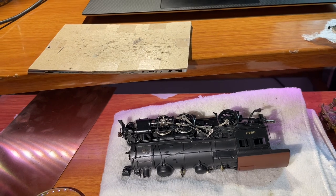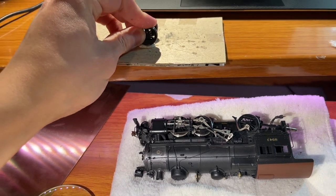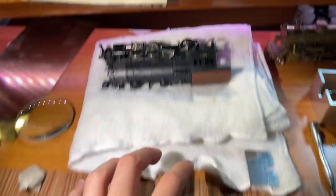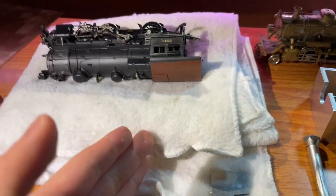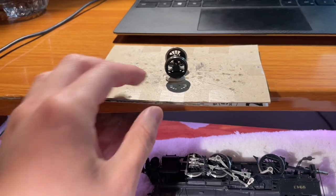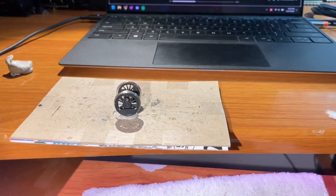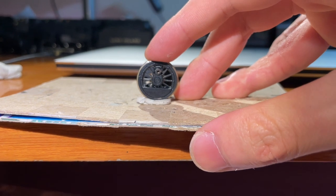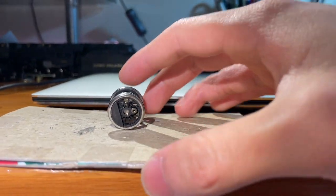This is far from properly 90 degrees, and I'm not going to push this wheel in by hand — especially with one hand. But you can see roughly that this has to be 90 degrees off, in this case to the left of the non-insulated wheel. So now with that done, we can do some fine-tuning. This is where a piece of paper and either some tape or silly putty comes in very useful. You can do this two ways — I like to put a little bit of silly putty on a piece of paper and simply place the wheel on it. You can also just put the wheel on a desk and view it from both sides. I'm going to turn this piece of paper to show both sides. Align this wheel to make sure it is perfectly at 12 o'clock, and then simply turn the wheel around and see if it's at exactly 3 o'clock.